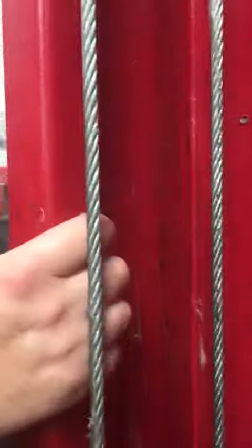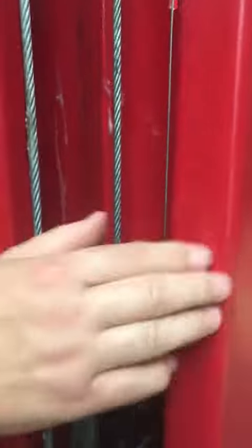The entire track needs to be lubricated — from the bottom to the top and down, on all four edges, so both the inside and outside. Don't forget about the inner lips and the outer lips. The reason is that's where your main wear is; your weight is more to the outside, so basically lubricate everything.